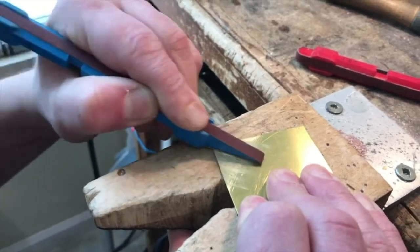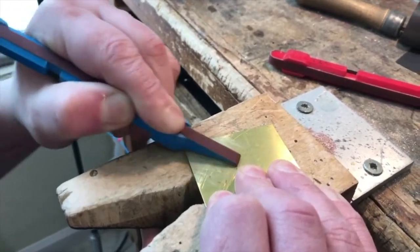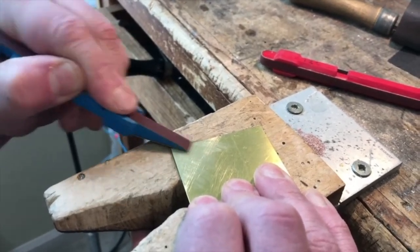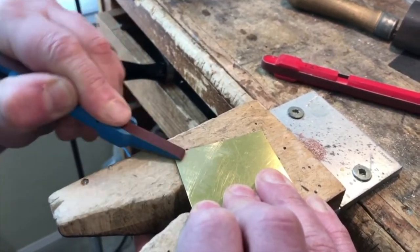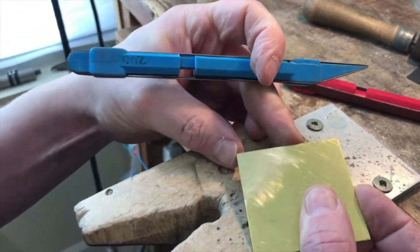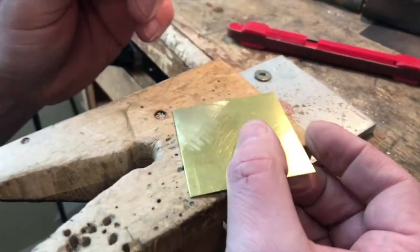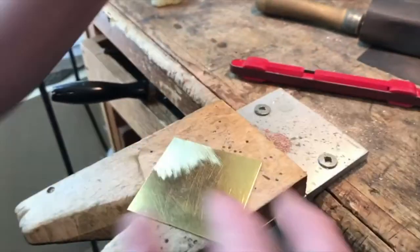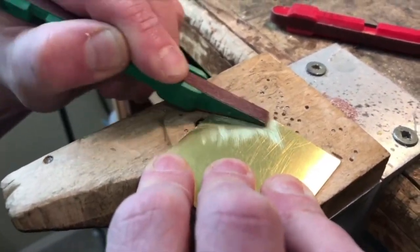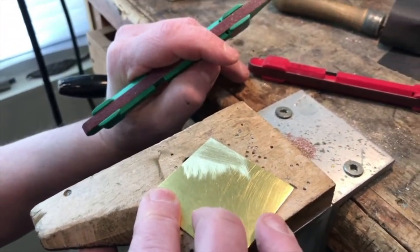You don't want to take any shortcuts. It might not be the most fun task that we do in the studio, but if you don't get those big scratches out now, you're not going to get them out in later stages. Just working your way through those different incremental grits — I've gotten most of the scratches from the 120 out, and then I would just continue rotating as I move into 320, which is in a different orientation than the 240 grit, and so on.